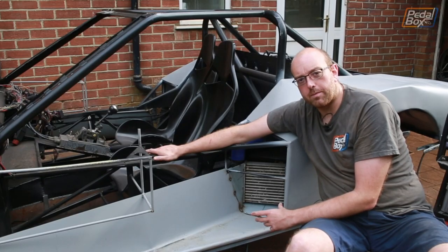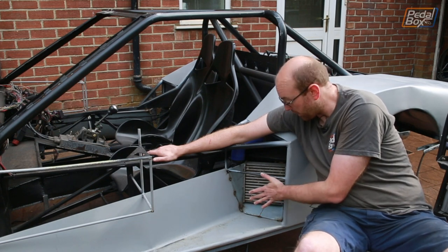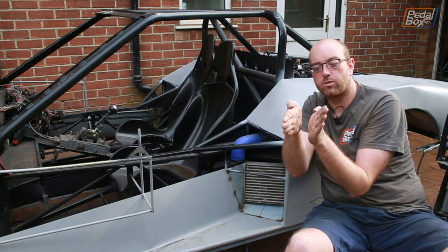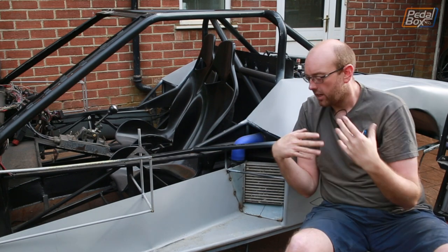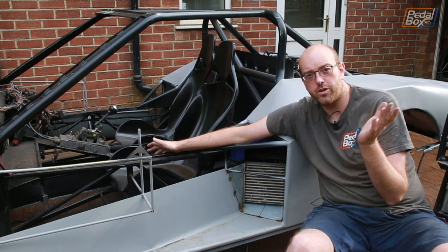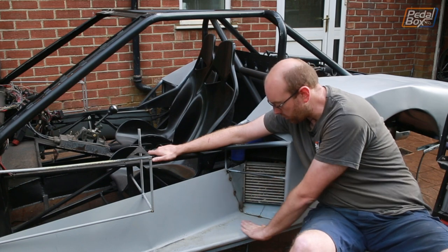Now something that's been plaguing me for quite some time is these air intakes. We were going to 3D print a duct which basically went from this plane all the way through onto the intercooler, and they're kind of like that. One's twisted, slightly off axis. It's not going to work because the geometry to do that is really, really difficult. Who knew? So instead, I've added in these extra two pieces of plate here to get a nice transition out